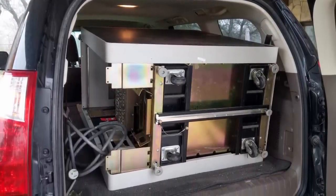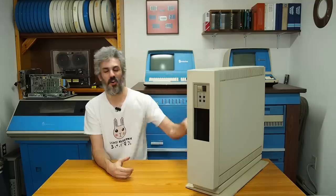It just so happens that I have a really nice PDP-1183 CPU with two PMI memory cards that we got in the original haul from Pittsburgh. That is a great PDP-11 CPU and I really want to put it in this machine. We could theoretically just plug it in right now, throw a terminal on it and see what happens, but it's pretty dirty. Not only that, the BA-23 chassis inside also desperately needs a clean. So the whole thing needs to come completely apart so I can strip it down to bare metal, give it a proper wash, clean everything up, put it back together, and we'll probably need to do a capacitor replacement on the power supply. Once it's back together, we'll slot the CPU and one memory card in, hook it up to a terminal, and hopefully there's life.